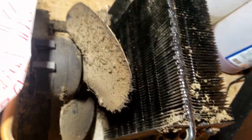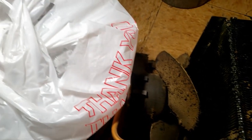We hit it with nitrogen and blew it all out. I don't think you can tell there's much of a mess now. Wouldn't surprise me if it's low on refrigerant, and wouldn't surprise me if the cap tubes are plugged up — it's been operated several times under bad conditions. Still investigating to figure out what's going on.